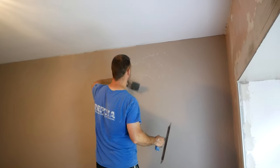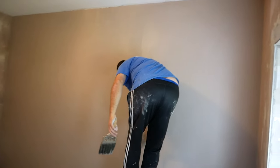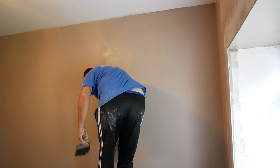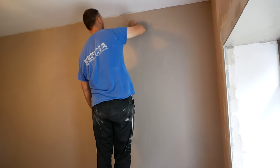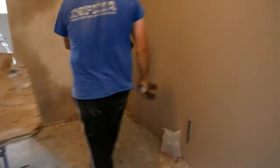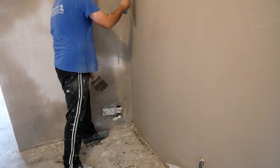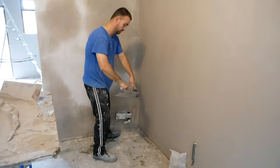You just need a bit of water. Just make sure you're pulling down toward the floor, and that way you're going to have a nice little finish. You don't want to be over-wetting. This nice clean trowel can clean any beads up off the wall that shouldn't be there. Just remember there was a wee lift already from last time, so we'll need a bit of a wash. You can cut right in at the angle, get a flush, and then call it.